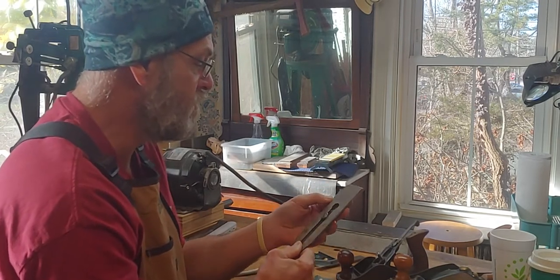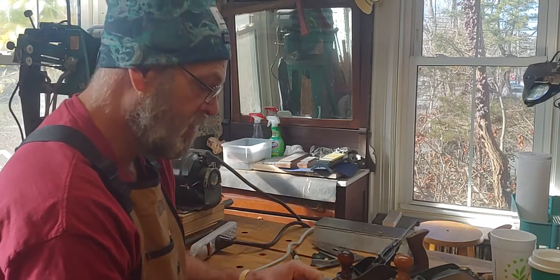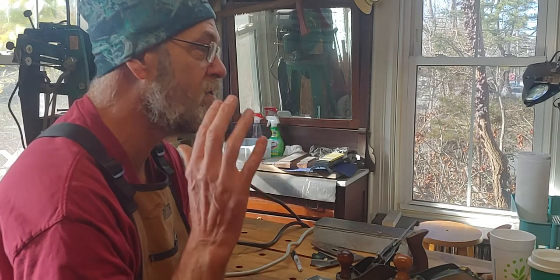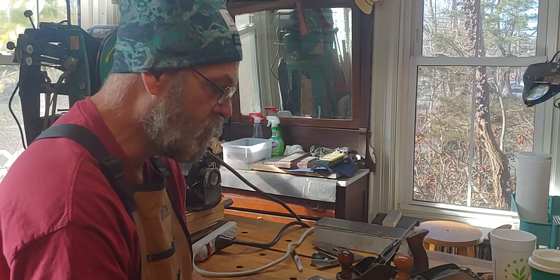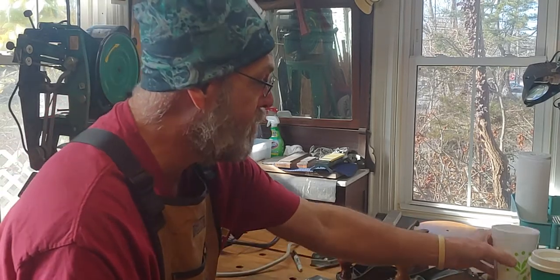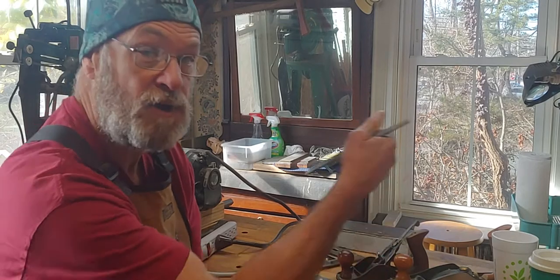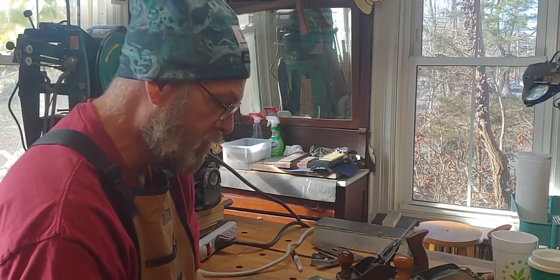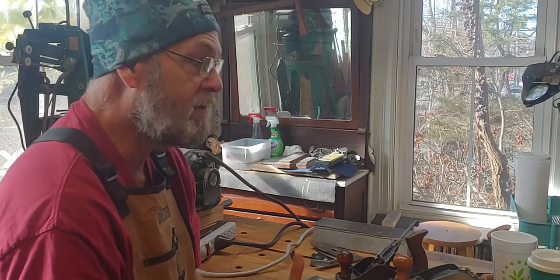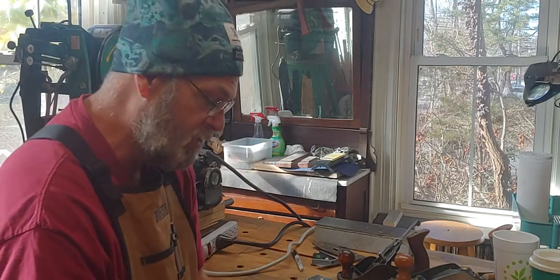This is where we get into 25s and 30s. What has been found in woodworking — unless you're into David W.'s unicorn method on YouTube — is that 25 to 30 degrees is the standard range. For everyday sharpening: if you're watching this, you probably struggle with sharpening and are trying to understand it better. The sharper your tools are and the better your bevels are, the more pleasant woodworking is — especially with woodturning and planing.